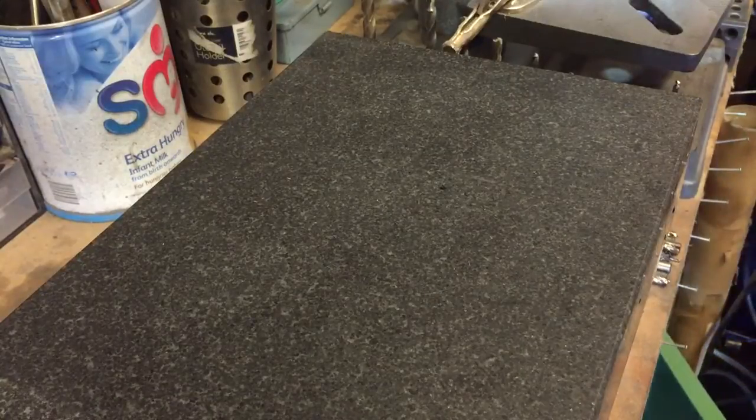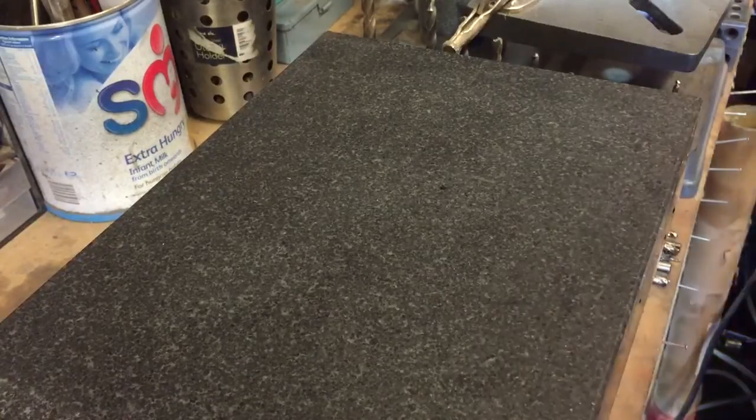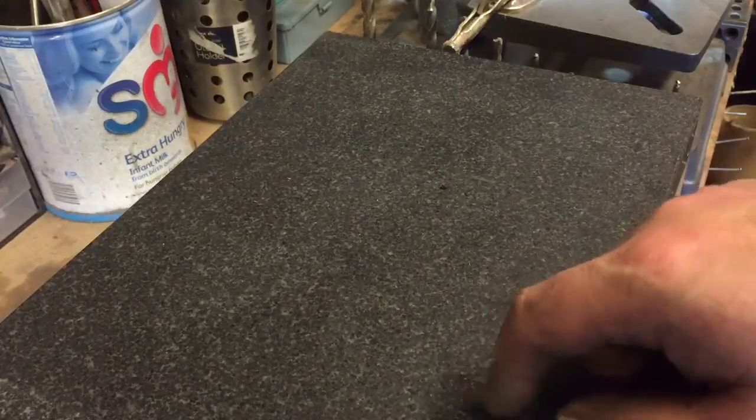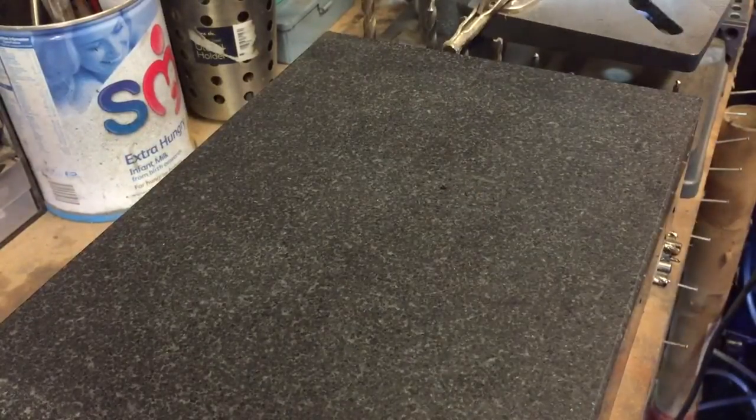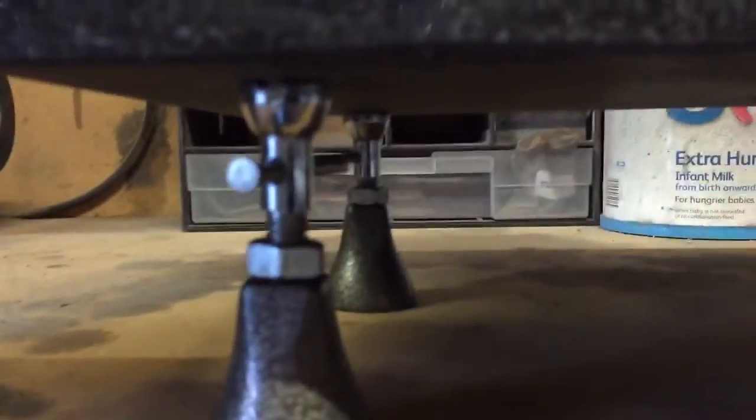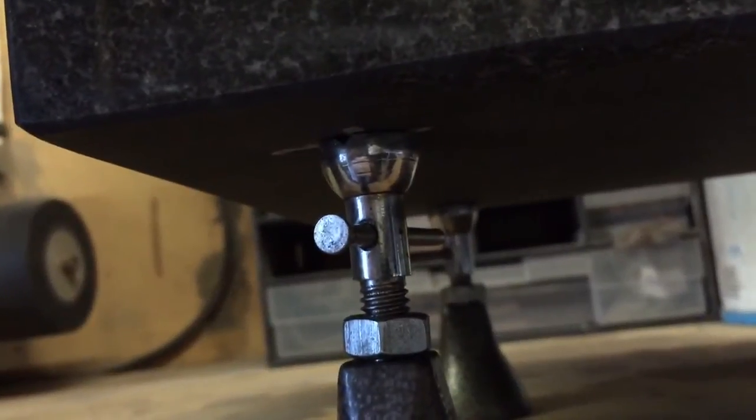Anyway, rather than take you off, underneath your surface plates, most surface plates will have an X here, an X here and an X there. And what you use is a little adjustable jacks. I don't know whether you can see, well, they're covering them now, but you could see it there a bit more. Let's see if I can zoom you in. See the little X's?